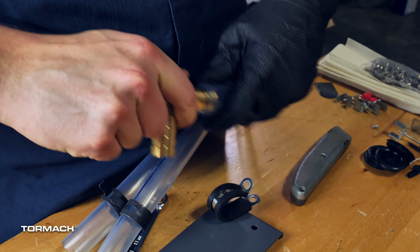Install the washdown bars. Open the windows on both sides of the enclosure. Remove the 2 rubber plugs from both back panels. Find one of the washdown bars, 3 loop clamps, 1 pipe grommet, and 3 M6 screws. Install the loop clamps onto the washdown bar. Put one of the pipe grommets into the hole in the back panel. Slide the barb fitting end of the washdown bar through the grommet in the back panel.